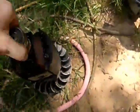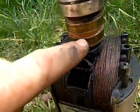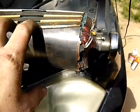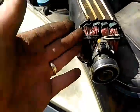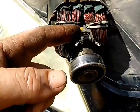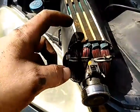This is a brushed generator head. If you look on this rotor here, you've got your positive input and your negative input. On this rotor over here, there is no input — this is a self-excited rotor. The difference between this one and that one is this one has capacitors and diodes. The capacitor is to regulate the voltage inside of this.